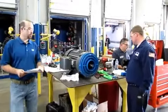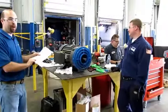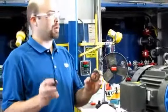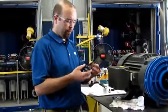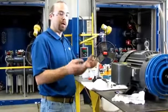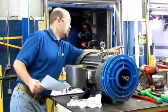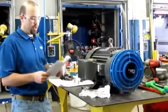Reassembly: we cleaned everything and checked the shaft for total indicator runout of five thousandths or less — we had about one thousandth, which was pretty good. On mechanical seal components: someone might say these look like they're still pretty good, let's reuse them. You never want to reuse these mechanical seals — they're a couple hundred bucks, it's just not worth the risk. The wear rings: if they're damaged, rip them out and put new ones in. Don't use never-seize or anything behind them because it can loosen them up during rotation. It's also not recommended to reuse an old impeller bolt and O-ring.